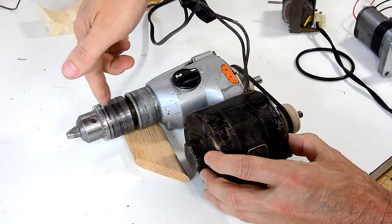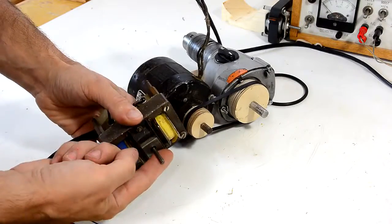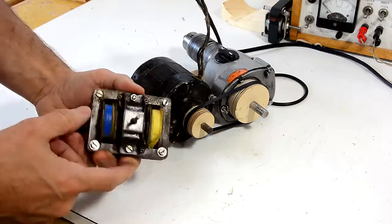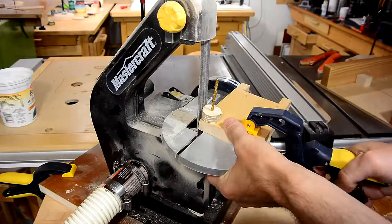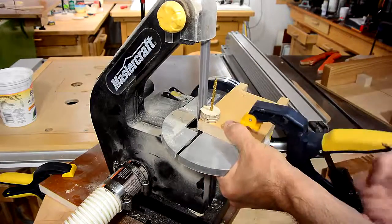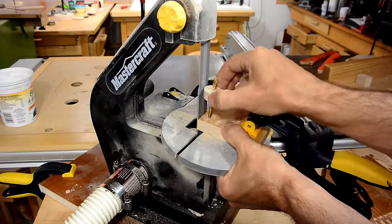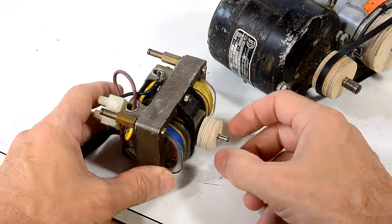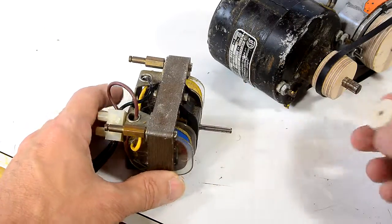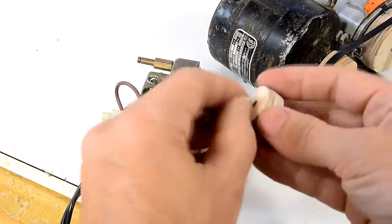Because I'd like to have a cam on here so I can produce more complicated motion patterns for the baby. So maybe this turntable motor might actually be enough power — this motor only draws about 8 watts when it's running and it's super quiet. I just cut out a smaller pulley and now I need to sand a crown onto it. Unfortunately it's a bit too loose, so I'm gonna try to get it tighter by putting some plastic foil in the hole. That's fairly tight.